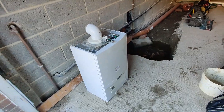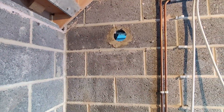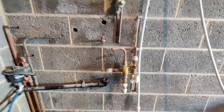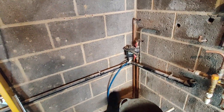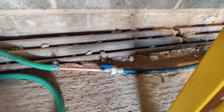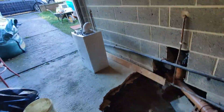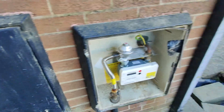The boiler is now sat here - it's been removed. I've cut all the pipework, got the flue out all in one piece. The solar malarkey is all disconnected now. The electric's turned off, disconnected and made secure. I've connected a washing machine hose to drain it off, going into a drain. I've also done a tightness test prior to going into the gas pipework - there are no gas leaks on it whatsoever.